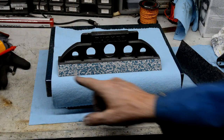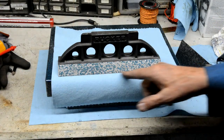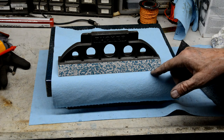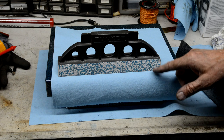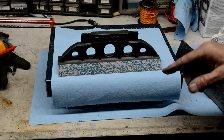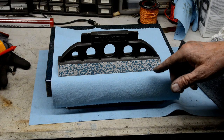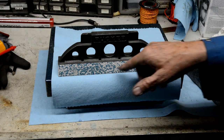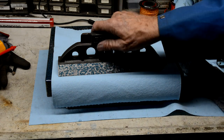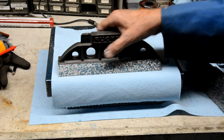Alright, the dovetail's done. I've got about 40 spots per inch. They're kind of blended together because I put the marking dye a little thick — if it was thinner, these would all break up. But I like that pattern. That's really good. Not much left on that one.